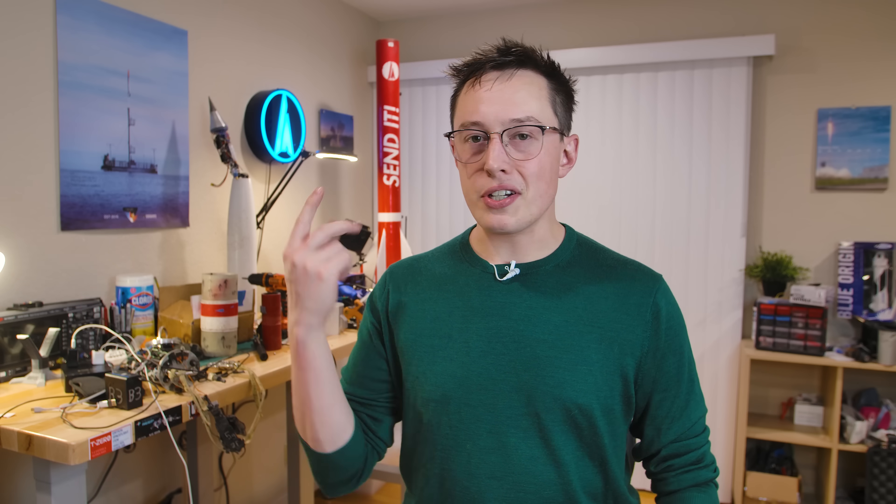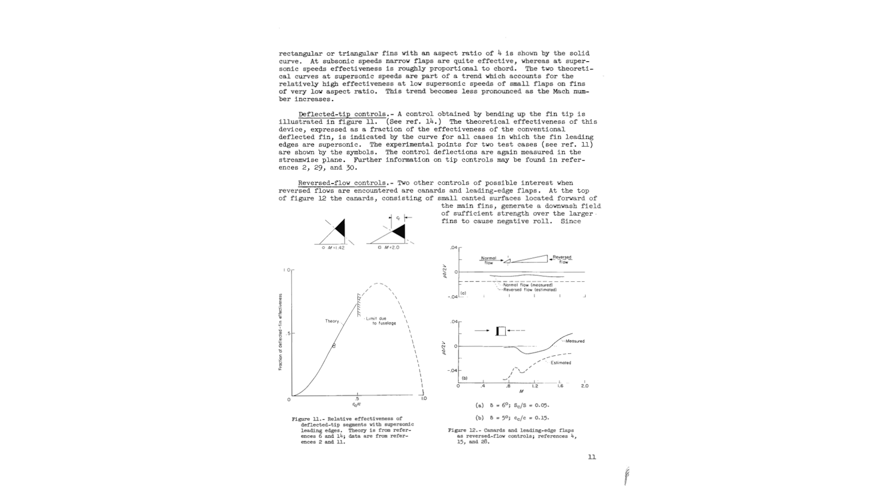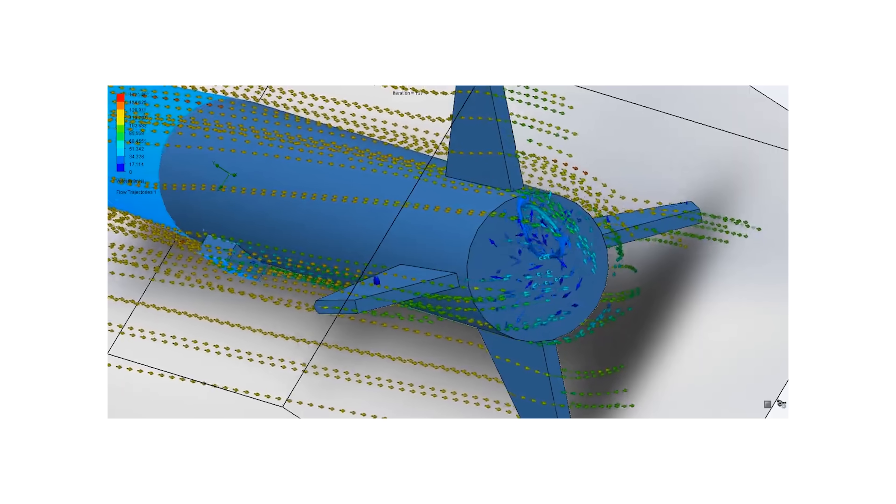This totally works. I have a good idea of how to simulate it, so what is the issue? The first and largest issue is that the cost of failure for this type of system is pretty high. If you have active control that fails, there's a good chance that you can rip your rocket apart if you're doing like Mach 5. It's worth remembering I'm trying to design all of these things to eventually do a space shot, so something that can scale up easily is important. The second is that fins are actually quite hard to simulate — it requires quite a bit of CFD and potentially wind tunnel time to get a good idea of what these fins are going to do at different flight regimes.